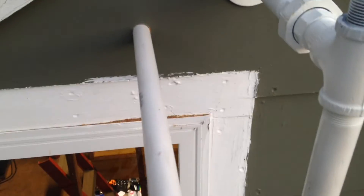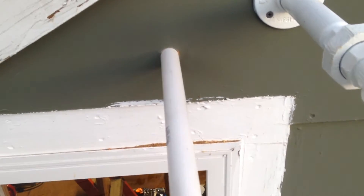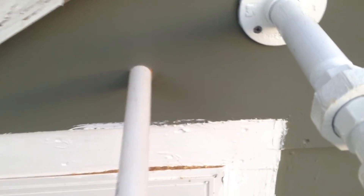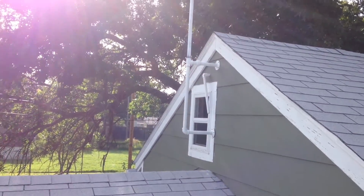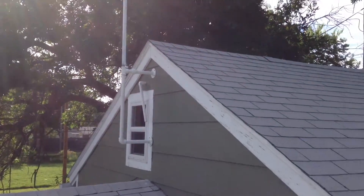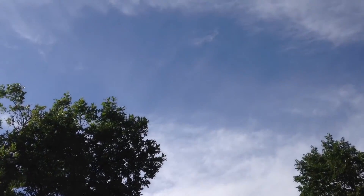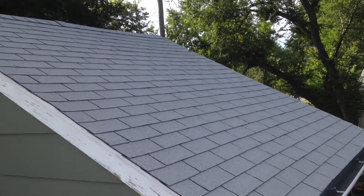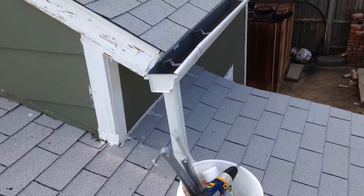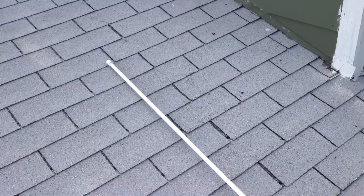You can see the three-quarter inch plastic pipe I'm going to run the coaxial cable through. It's actually going to have an elbow right there and a little short stub pipe, and then I'll tack it down. I'm finally ready to put my antenna on my antenna mast, and as you can see, Cox Communications has come in and moved all their lines for me — which was a pleasant surprise. There are my tools and there is the antenna.